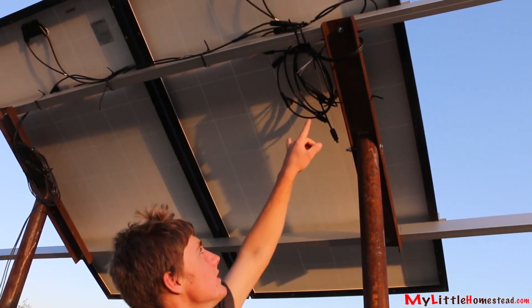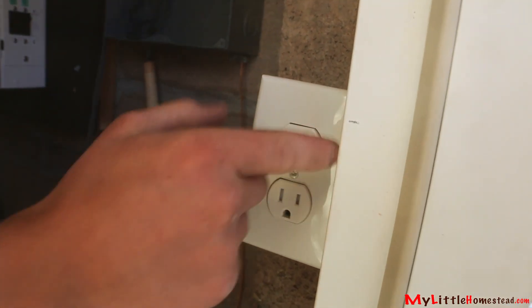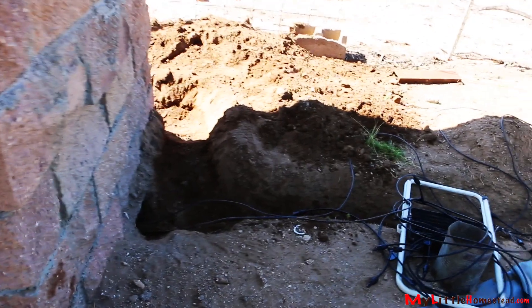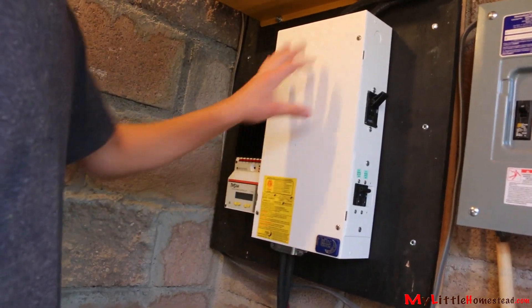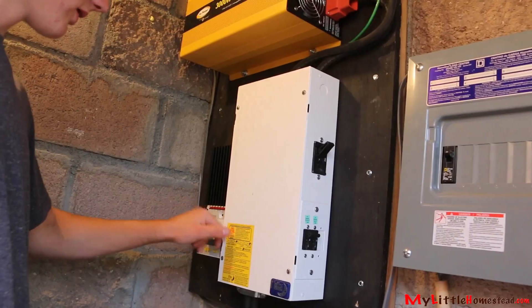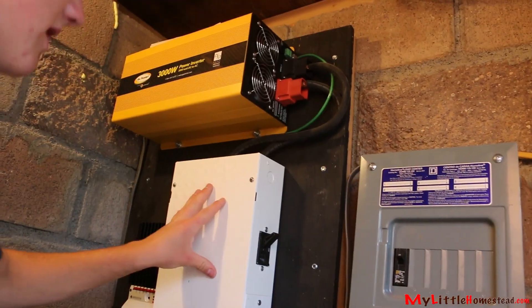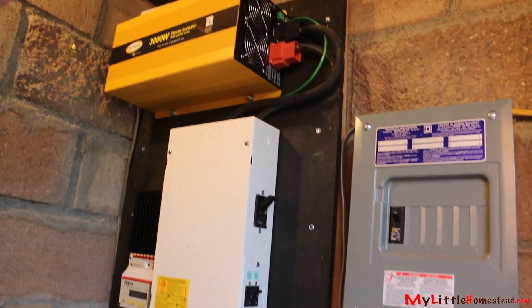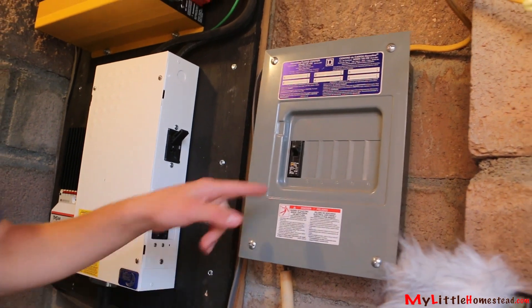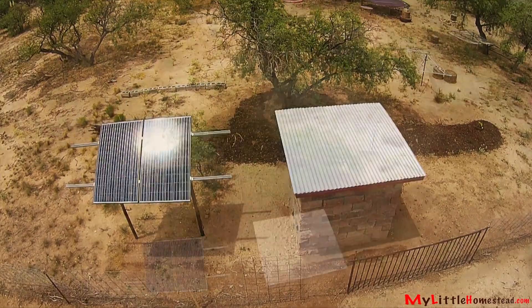This line up here is officially running off of solar, and it's running off this light switch. Here are our solar panels, where the main power comes out from the outside and goes into this box. This box goes into the controller, which has a bunch of setups. The controller regulator will actually control and regulate the voltage going to the batteries. The rest of the power that comes out will then go into the inverter, which converts DC to AC. The AC power will come over here to our electrical box, which is 120V. The power then runs from the main solar system right into the garage room.